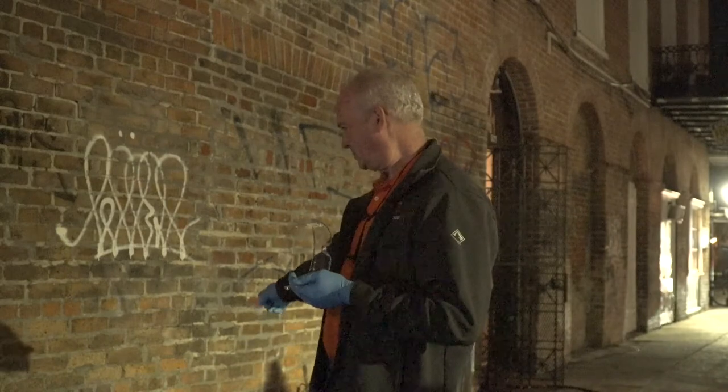The protectant that you sprayed on the wall? Yes. How long does that last? If you were to hit it with graffiti remover a bunch of times, you would eventually start to wear through it. But just as it sets, as a water repellent, it'll last for 10 years. We're hoping that in a graffiti protection deal, if you're using a mild stripper like that with low pressure, you're going to get 5 to 7 years out of it. It will eventually break down, but it's a silicone. It's really tough. And substrate would actually determine the lifetime of the product.